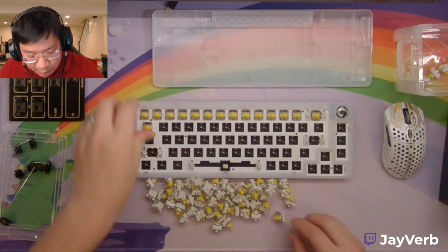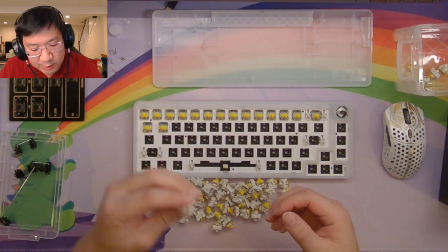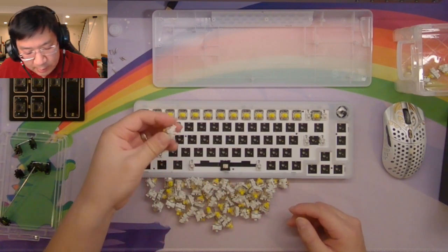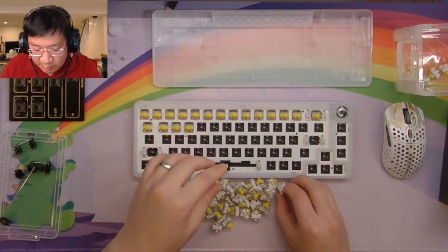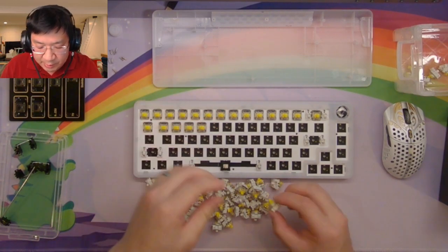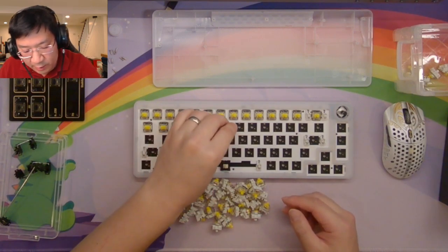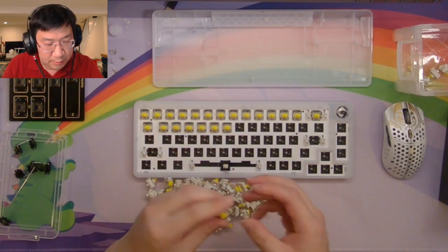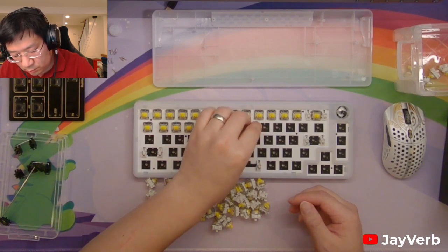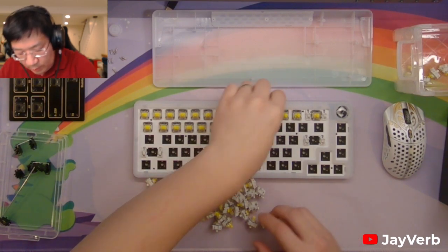And then beyond that, I'm going to keep plugging away at these, checking pins before I put them in. Because I don't know how many times I've damaged random hot swap sockets and had to break out soldering irons and hope that I can make a connection or jump something. It's not fun, but it is part of life, if you're not careful. Although I have to say, I think hot swap sockets and the boards are being better designed, so I don't have as many issues, but it is a thing. Alright.